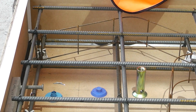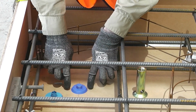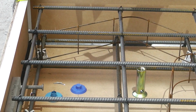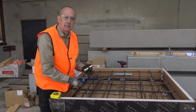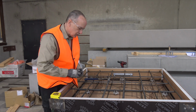And the other dimension I've previously checked. Line up the insert nail holes with the line, center the other line in the direction, using the nails and the hammer, fix it to the form, and we're done. I won't actually do the install in this case. We're going to be doing a near face application for this panel.